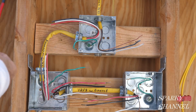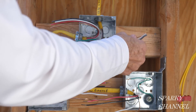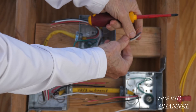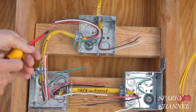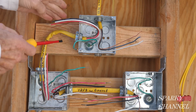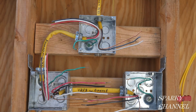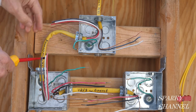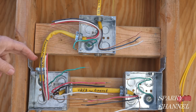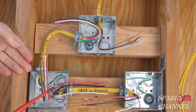I'll show you the cabling first. We have the power coming in — this is a 12-2 with ground, so you've got two conductors: the black and the white, and a ground. This is a special way to wire this so that you only use two cables — one cable here and one cable here — so you don't have to have a cable coming this way, which saves you in cabling. The disadvantage is you have to use a 12-3 with ground to get from here to here and then to over here, but there's only two cables, so it's pretty cool.